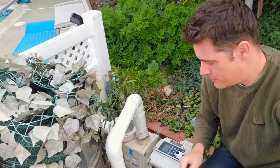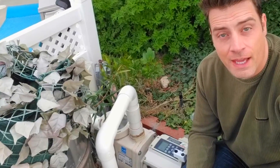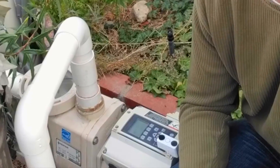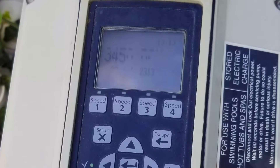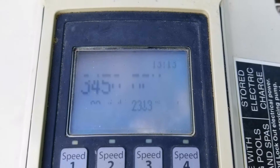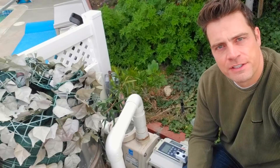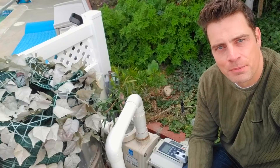What explains this episode is this. This is my Pentair IntelliFlow pool pump, and it's developed quite a common problem. There are a lot of posts on forums from people asking for videos on how to fix this, so that's what I'm going to try to do. Sometimes the LCD display can freeze, sometimes it can turn off completely, but the pump will still work. Some people say this is down to moisture getting in or corrosion, but it seems that on the forums people are finding that this is actually due to a loose connection in the LCD display, which you can fix using a pretty simple method.